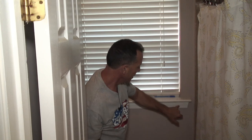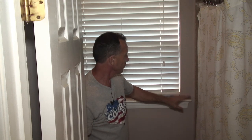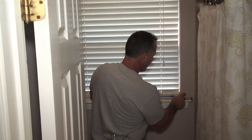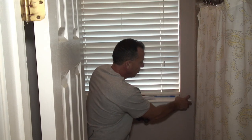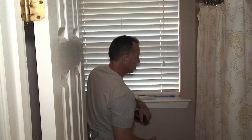I'm going to leave the windowsill because we don't want to make this complicated. You can take it off if you want, but I'm going to leave this one and replace the trim piece because I want it to match the trim around the face. We have our measurement here and I have three inches from the edge to this side, so we'll probably make this about two and a half inches wide so it comes over and still has a little room on the side where the windowsill goes past it.